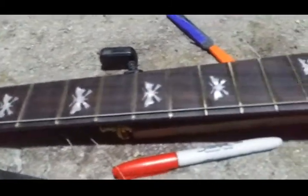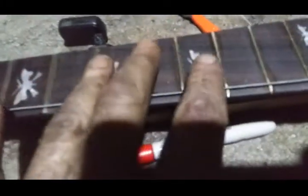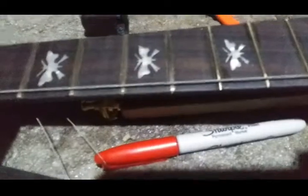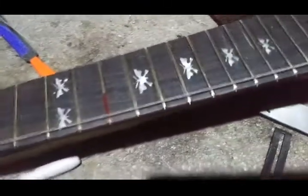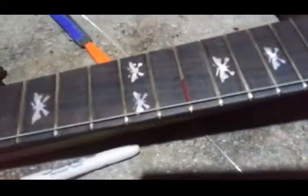What's going on is that the fingerboard is only attached right at the center. And the thing is being really problematic when it comes to getting the frets level when it's under tension. It's flexing so that different spots become high, and it's probably not flexing in a repeatable manner. I don't even think a PLEK machine would be able to get this thing okay. Every time I put it back under tension, a different fret goes high on me. So I'm gonna call this a fail.